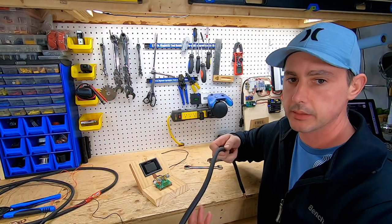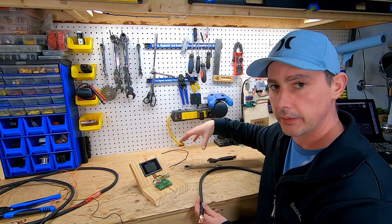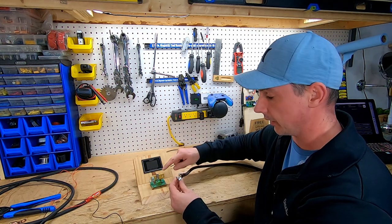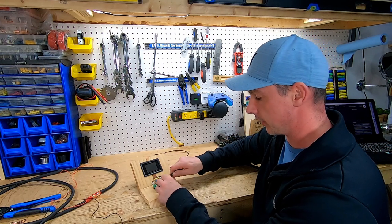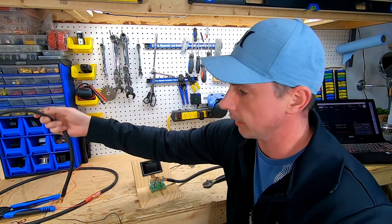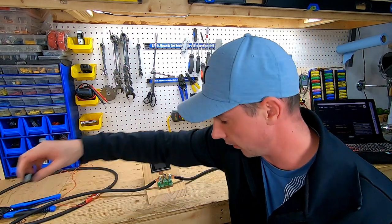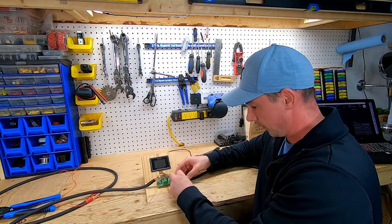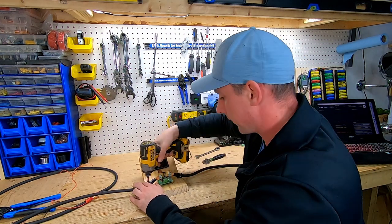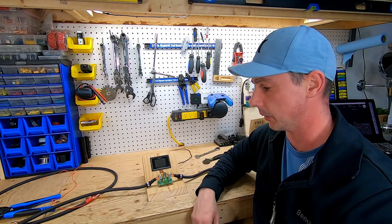Now that's all there is left to do — make my connections. I'm going to have the load on this side and my inverter there, with the batteries on this side. I'm going to want my lug straight up against the shunt for best accuracy. Now on to my second cable, and I'm going to secure them with some clips to hold the device down to the piece of wood. Now I need to run my battery positive.